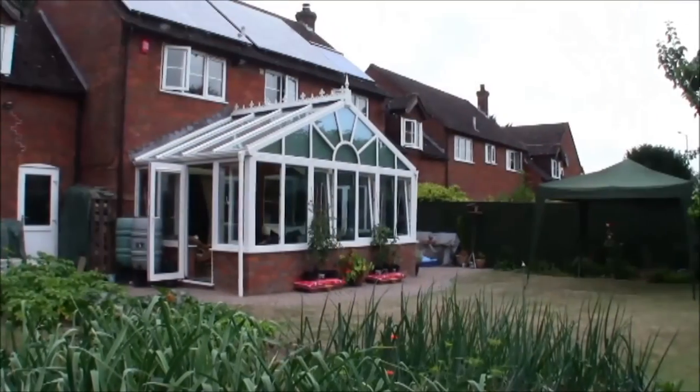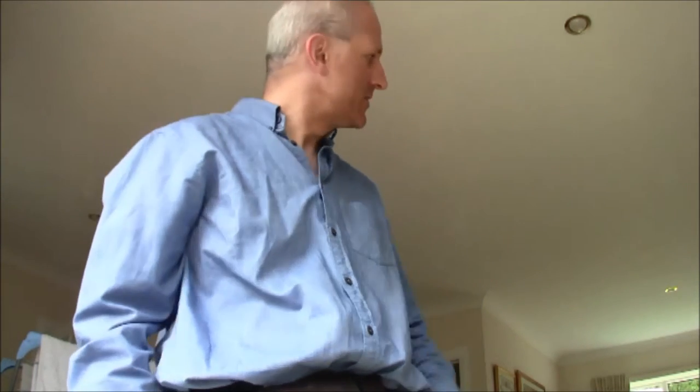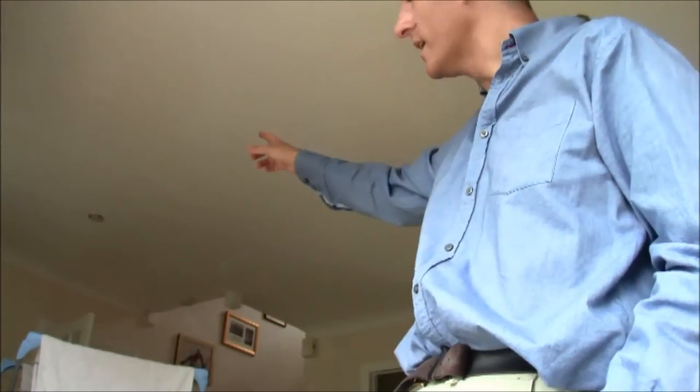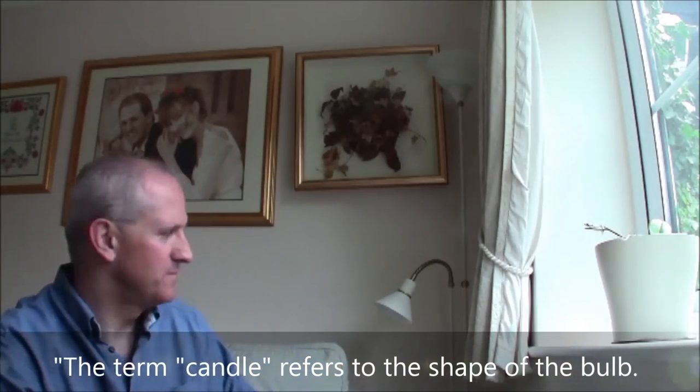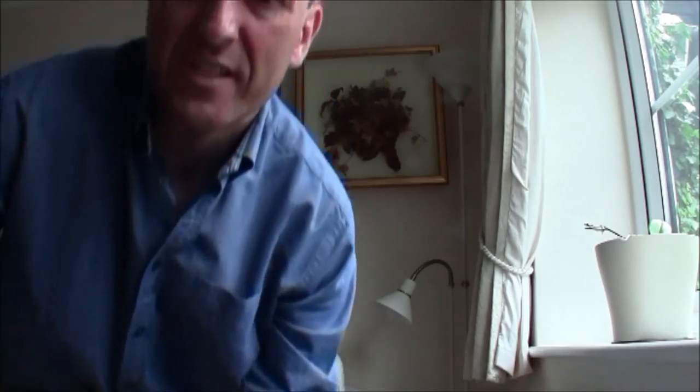As long as they have the standard mount — and of course they all do, with the possible exception of some halogens which we'll discuss later. Here in the lounge, all of the light fittings are embedded LEDs — one there, one there, one there, and a fourth in the hallway behind me — all R64 LED fittings. Behind me is a corner light unit freestanding on the floor. The upper bulb uses a small Edison screw with a candle-like fitting; the uplighter fits a larger E27 Edison screw, an 8-watt bulb.